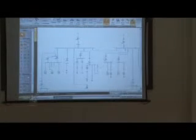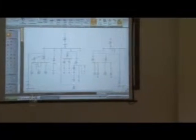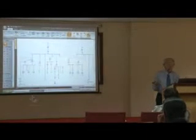And I do not want to bring my stability study up to date while we're standing here. One of the programs they have is stability. So if you want to know, we had 2 generators on this bus. We had a little one at 2300 volts or something, then a big one at 13.8 kV. If you lose the utility supply, is the system stable? Will it pick it up? How quickly will it respond? And I don't have that data either.